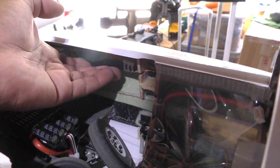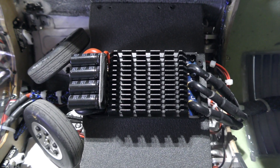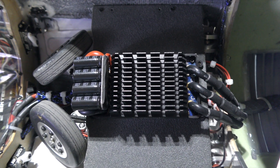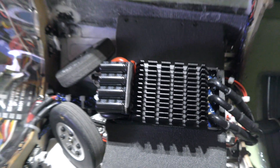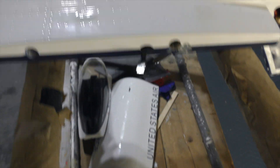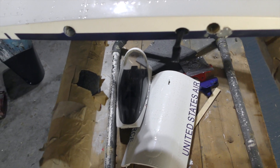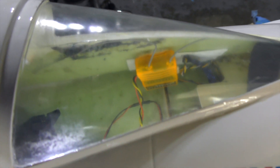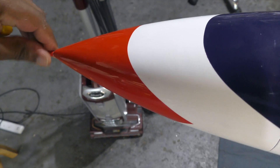The wiring is pretty clean, and I've used snakeskin to prevent chafing so it can go through all of these grooves correctly without any wires getting cut. Obviously we have the ESC — the HobbyWing FlyFun — it's a decent ESC used to power the motor. These are the wires going from the light controller to the wing lights to power those LEDs. I'm using an Orange RX receiver — one receiver is here and one satellite is in the nose.